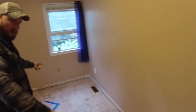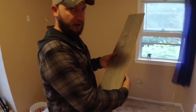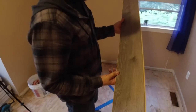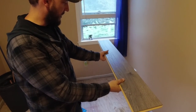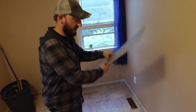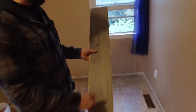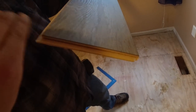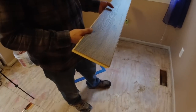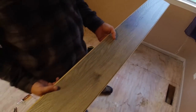So now we can start our first row. Most snap-together flooring is very similar where you have the tongue right here and you have a groove on this side. The way you want to install it — I'm starting here — so I'm going to install the tongue towards the wall. The other tongue goes into the groove a lot easier than if you did it the other way, because then you have to go under and it's just not that great. That also makes it so this end is up against the wall and then this end you can easily put the other piece into. So you're putting the small side up against the wall, and same with this side — that small side is going up against the wall. Easy, makes sense.